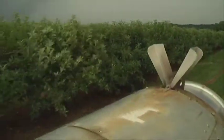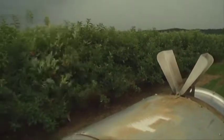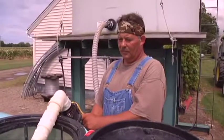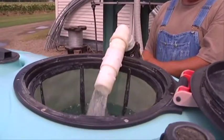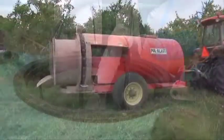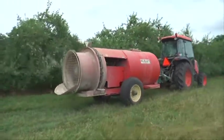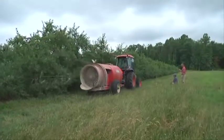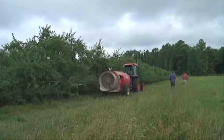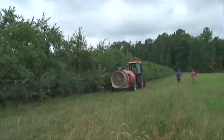Make sure to travel more than 200 feet in order to get an accurate speed of the tractor and sprayer. During this timing, you should be pulling your sprayer with approximately a half tank load of water. During a field application, when a sprayer tank is full, your average speed will be slower. As it approaches empty, the speed increases. A half a tank represents the average overall load during the course of an application.